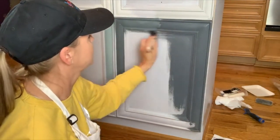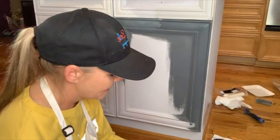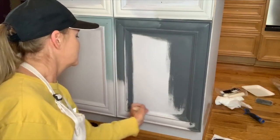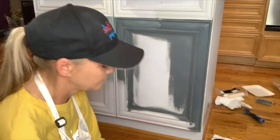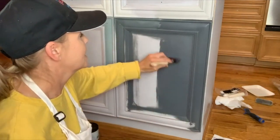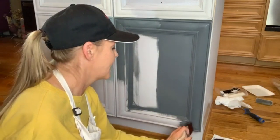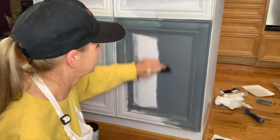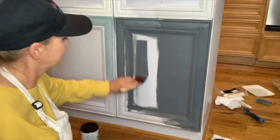Mist as you need to. Right now I'm just getting the paint on and then I'll even it out. That's why I like this little angled brush — it gets into all those corners. I use water to even it out so it goes nice and smooth with fewer brush strokes. This is going to take two coats because I've got Slick Stick underneath — I'm definitely doing two coats. I'll be sealing it with clear coat in satin, which is the easiest clear coat to work with.